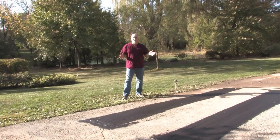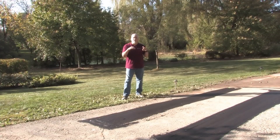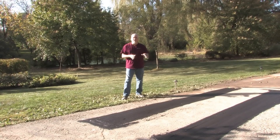We've come to the end of our project and the electric heating cables are now installed into this asphalt driveway. If you've just put in an asphalt or concrete driveway and need to get rid of snow, we can make saw cuts into the surface, press the cable down into those cuts, then come back and seal the whole thing up so no water gets inside. You can see we did tire tracks here, which allows us to keep that area nice and clear for traffic.